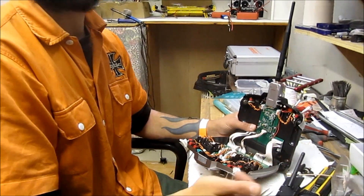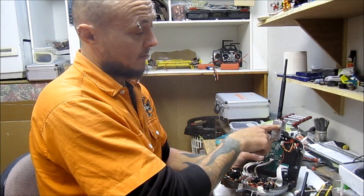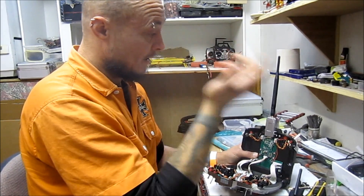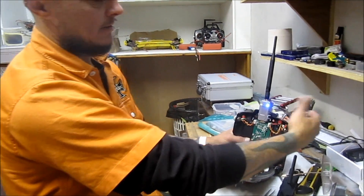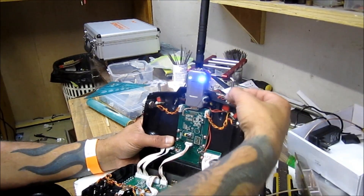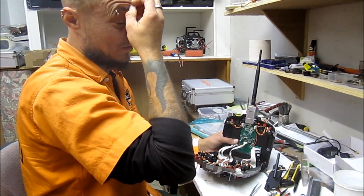The battery was good — full 10 volts — but the voltage on the screen was showing 9.1 and the booster started acting strangely as well. The solution was to mount a separate switch, from the main battery, specifically to switch on the booster.